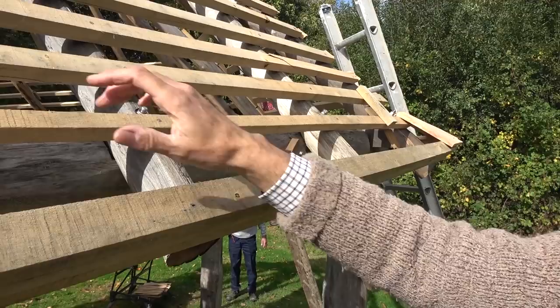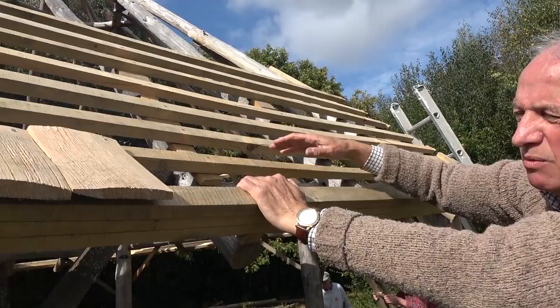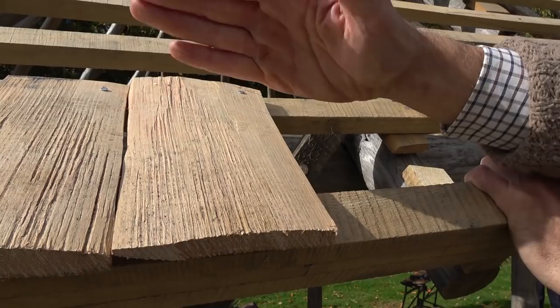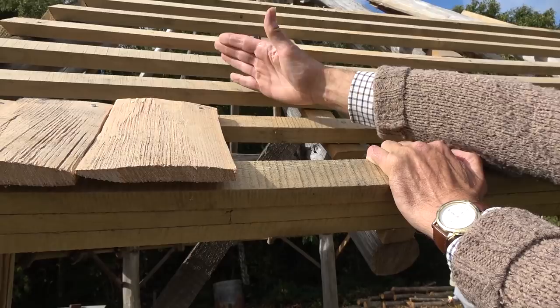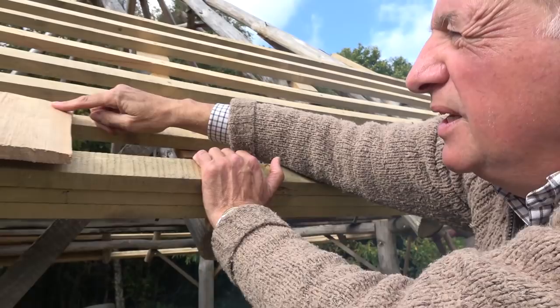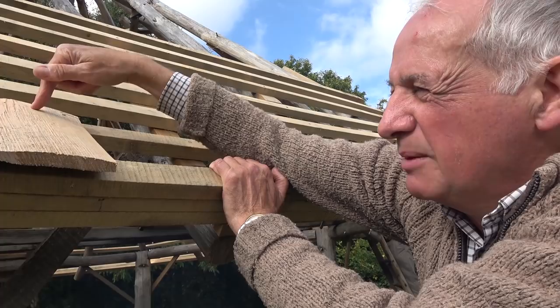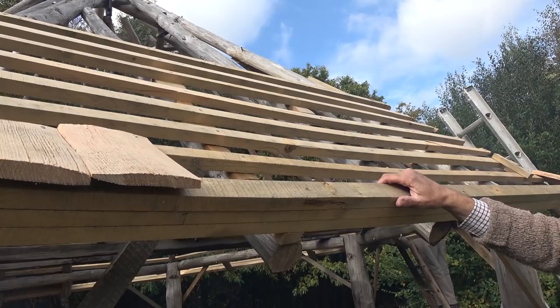So that's it — the laying is the simple part; getting the battens correct is the more difficult part. On these first shingles here, just one nail is used because they could be caught with the second one. This is the only time you nail at the top. Some people put a secondary batten in but it's pointless. We've only got two cover at this point, but it's outside of the structure itself, so from there onwards it would be three cover. On the next shingle laid, the nail goes through the same point, so that one will have two nails, and so on all the way up.